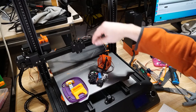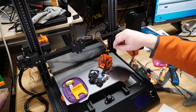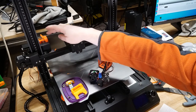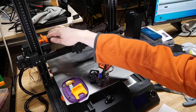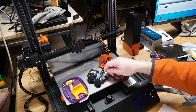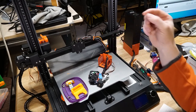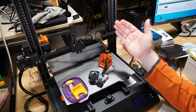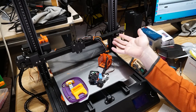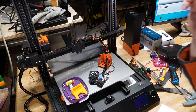This is a Bowden-fed setup with a very inexpensive hot end that's been very problematic. This extruder has the notorious habit of the set screw coming loose and slipping. The other issue is the hot end — sometimes you have to add an insert inside because you can get some popping. It's just a classic case of a nice little printer with a really lousy extruder and hot end.